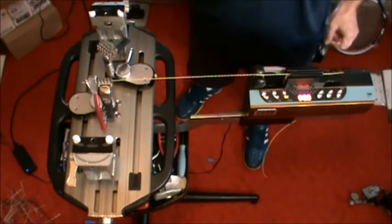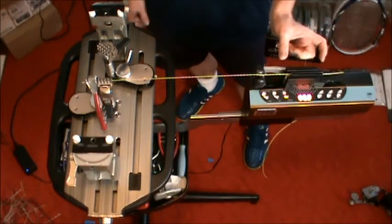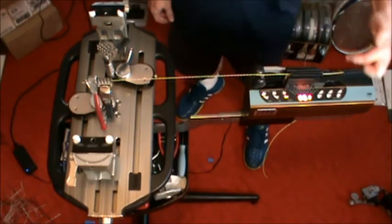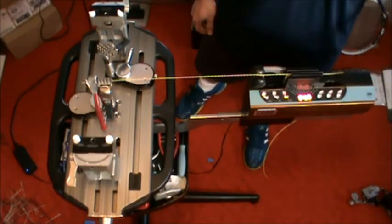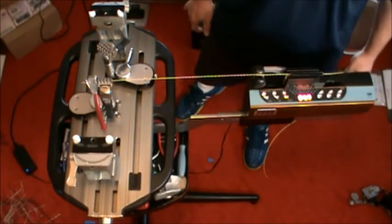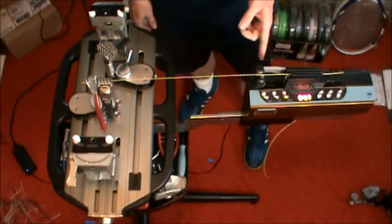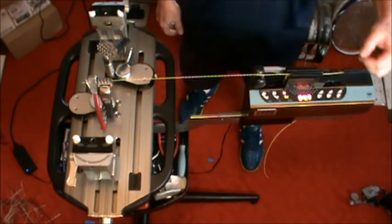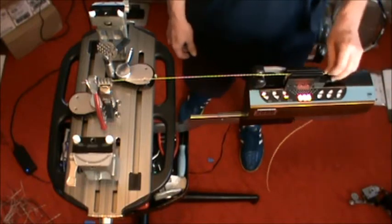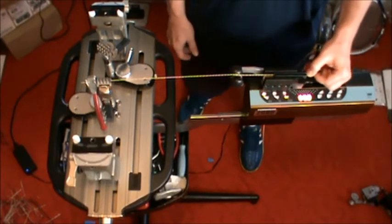And you might be able to hear the tension head periodically pulling, and that's because this string is relaxing. If we didn't have it in constant pull mode, these numbers would be dropping instead of staying for the most part at 55. So that's what synthetic gut does in constant pull mode. So let's take a look at how differently things are.